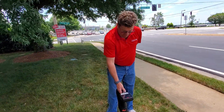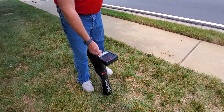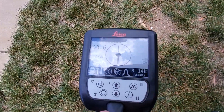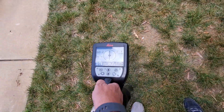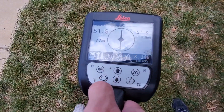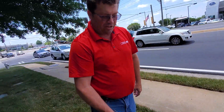There are a couple more things we can do. We'll go back to peak mode, take a depth reading of 5'2", and pull it up a certain distance. We take another depth reading and it's 5'9" — we've moved it up about 6 inches. That's another indication of a round signal.